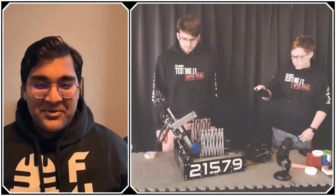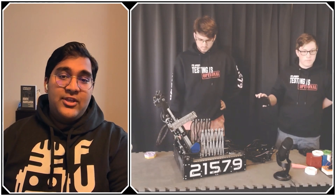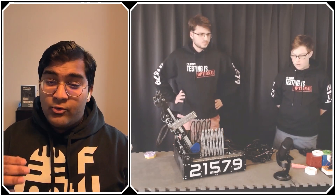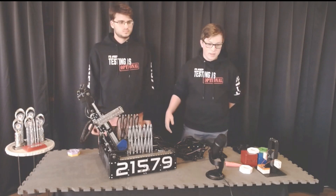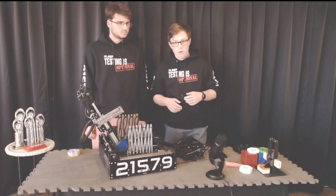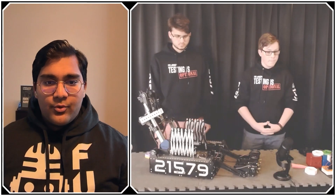One thing I noticed on the model and in close-ups is that when powering only one mechanism, there's some wobble or drift in the other axle set. Is that an issue? It definitely is to an extent — it does introduce drift in each subsystem. One of the main ways we counter it is by driving everything back beyond the minimum position to reset to zero. We would prefer to use encoders on the output axles, but we weren't able to get any, so we just use the encoders on the two internal motors.